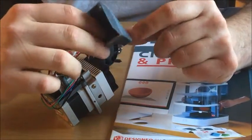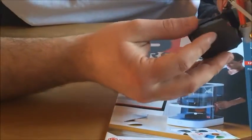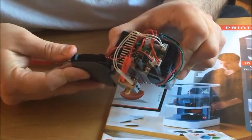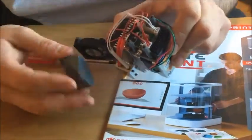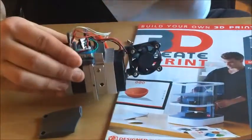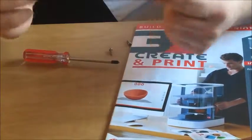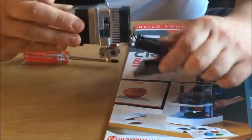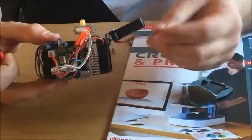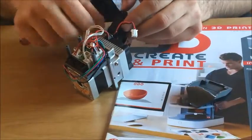What I've actually done is used a Stanley knife and cut the corners away slightly, just to make room for the screws protruding from the bottom of the fan. Now when you put it on, the screws don't get in the way and it fits nice and snug. That's the first thing I had to do. In order to fix the issue of it cooling the nozzle down too much, I'm going to disconnect the fan from the extruder control board and unscrew it back off of the brackets.